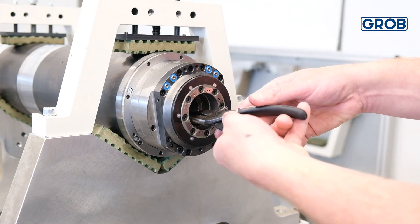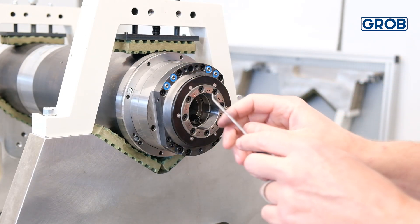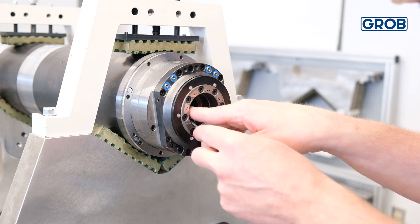You want to avoid them falling into the conveyor. Once all seven fingers are removed, use a pair of needle nose pliers to pull out the spring-loaded bushing. Use a pick set to remove the O-ring from the draw bar.